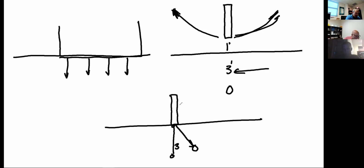Is it going to take a little bit more time to do this? Yeah, not much. But especially when you're doing a depth measurement for yourself, get more precise, take your time, and make sure you're directly over the cable that you're trying to get the depth measurement to.